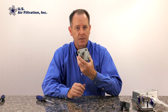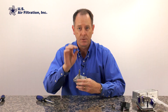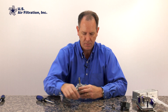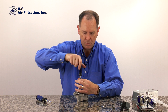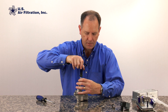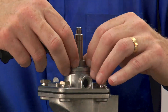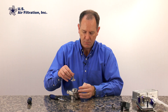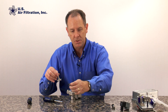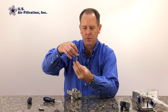To remove it, you'll see right on the top here there are just three screws with a phillips head that we're going to remove. There's a little washer on here — make sure we remove that and save it — and simply remove these three screws. Once we have the screws removed we're going to pull this up. There's the plunger and the spring that we're going to replace, and there's this little aluminum housing piece that goes over the housing.